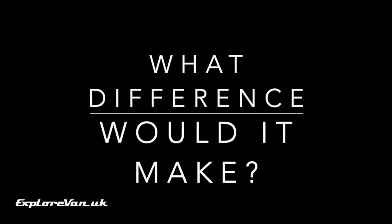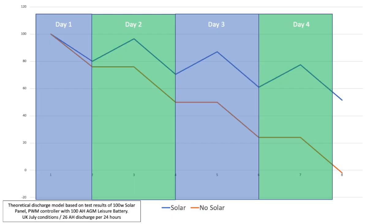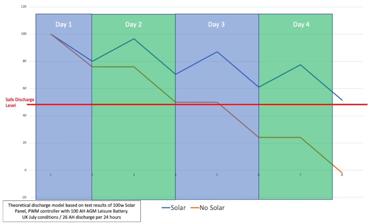So in real life, how much difference is the panel actually making? In this visual you can see in orange the discharge rate on the leisure battery without the solar panel, and in blue the discharge rate with it. Bearing in mind the generally accepted safe discharge level of an AGM battery to prevent long-term damage is 50 percent, the battery without a solar panel hits that level before the end of Saturday. Whereas the battery with the solar panel wouldn't hit it until day five — the Tuesday of our hypothetical long weekend. Do bear in mind that although these days weren't constant sun, the amount of solar energy in other seasons could be significantly different, and this setup is only going to be operating at this sort of level from late spring to early autumn at best, with days of poor weather taking their toll.